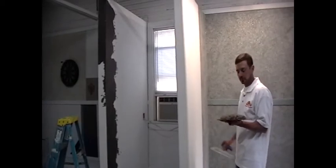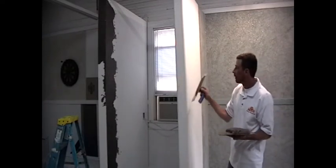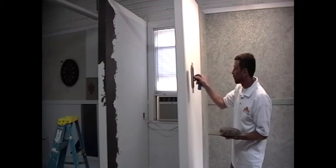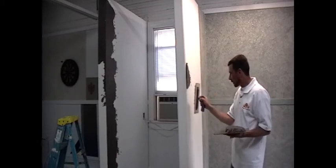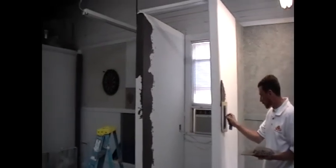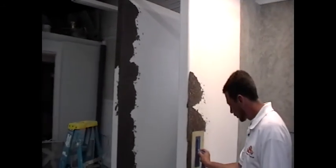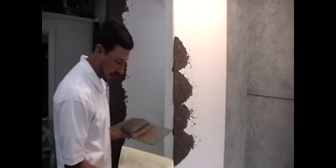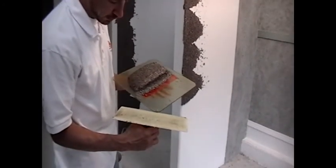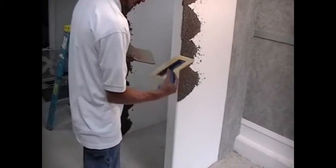We are now going to wrap a radius corner. To start with, you will squeeze about a half an inch to an inch of material over the corner, the same as wrapping a square corner. Eric will do 3 to 4 linear feet vertically and will pull the material 6 to 12 inches onto the wall side. Again, these are the same basic steps as the square corner.